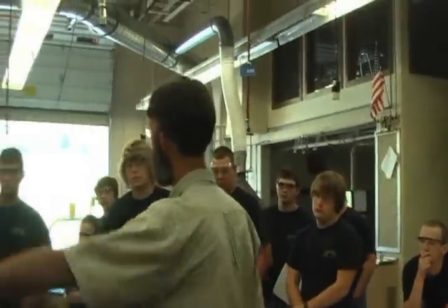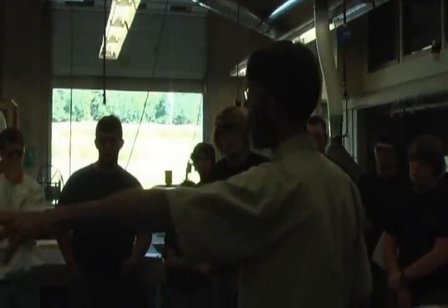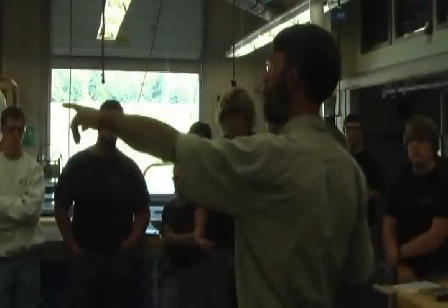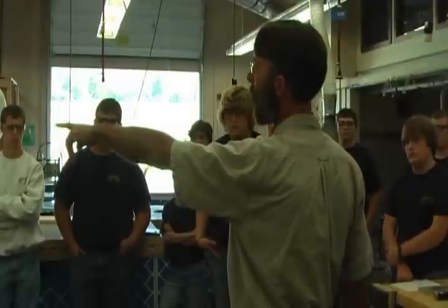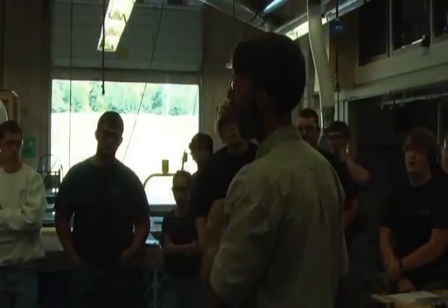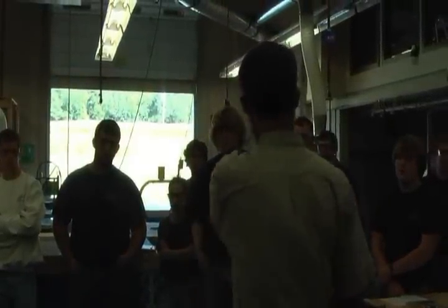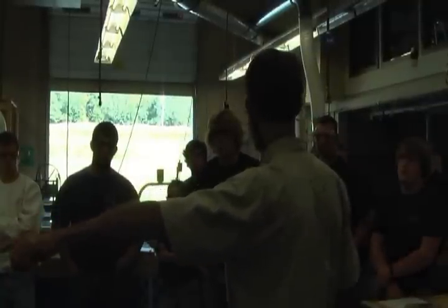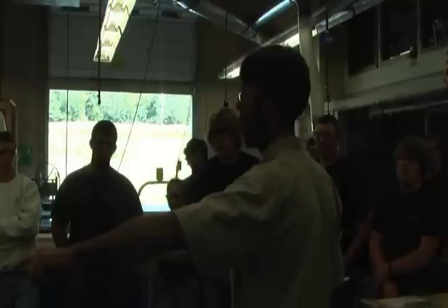And while I'm doing that, I'm thinking, this wheel is throwing a lot of stone at me. Remember that eye safety deal? You gotta get something in your eye. Heaven forbid. What's the best thing to get in your eye? Not stone. Not even wood. Metal. Steel. They go into the doctors to take that out. They can actually use a magnet and try and get that out. Wood they might not get out. Stone they can't get out. Plastic they can't get out. That they have to go digging for. Okay?